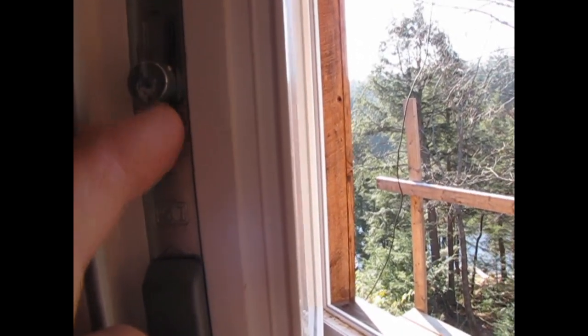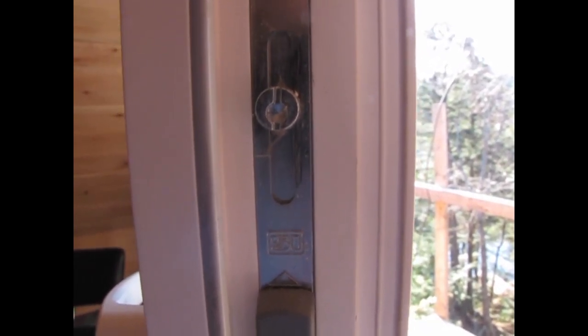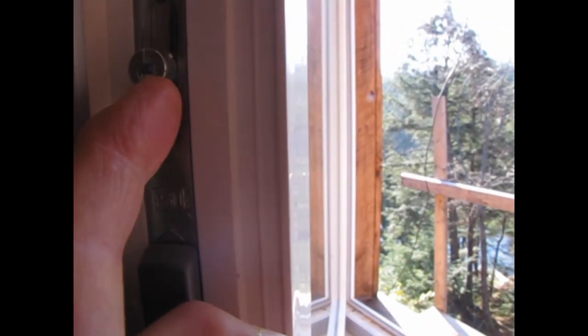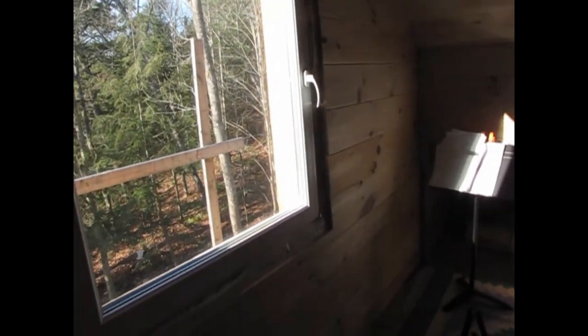The latch is shaped like a cam — it's lopsided. I've been using these windows for over 30 years. If you ever hear sound coming in, that means air is leaking. Sound travels through air. If you have water leaking in or feel a draft, you can take an Allen key and adjust the cam so it pulls the window into the frame tighter. There should never be any air leakage — tight like an aircraft door.